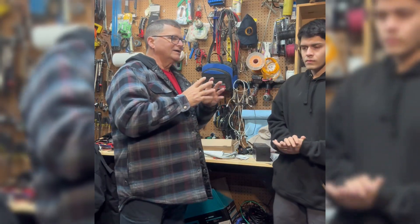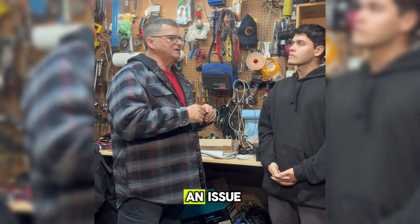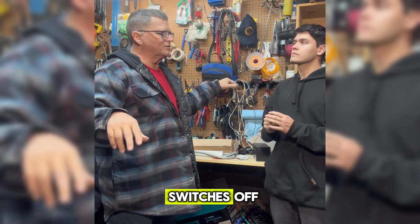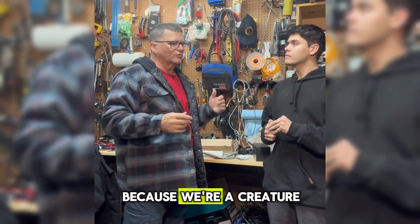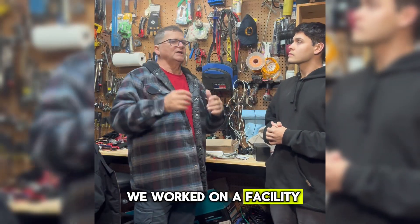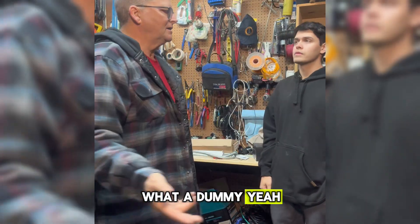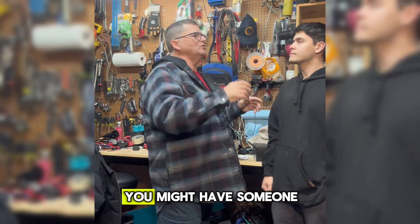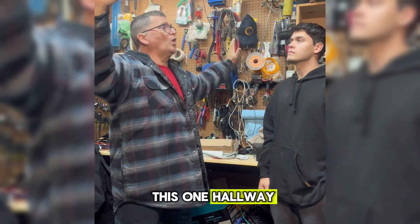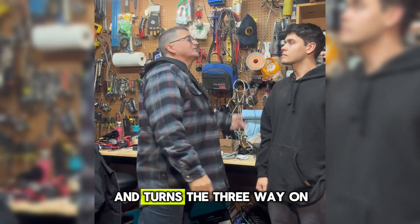However, getting hit by 277 volt versus 120 volt is always an issue. So my first advice is don't just take the light switches off. In a commercial building, because we're creatures of habit — how many times have we turned the power off, but still went in and turned the light on? You might have a colleague come in, you turn a switch off while working on one hallway, and then someone walks in on another hallway and turns the three-way on.